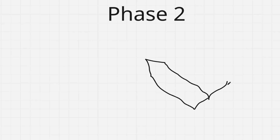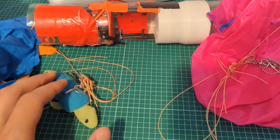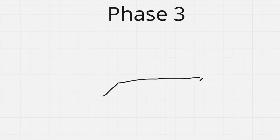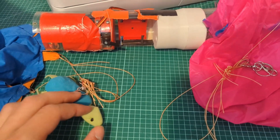The second phase would be flight testing an existing parachute I already had as a passive payload on a rocket. The rocket would still recover under a normal round parachute to make sure it's safe, while the cruciform parachute would be ejected out the side to recover its own little payload. The final phase would be testing a purpose-made nylon cruciform parachute to recover the rocket itself, putting all the stuff I've learned together and testing descent rate and packing methods.